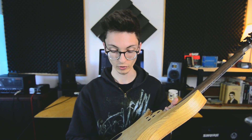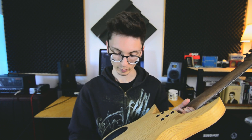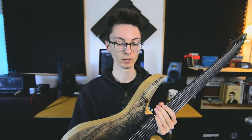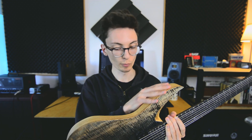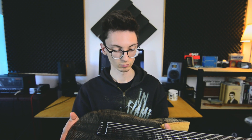I think I'm going to try a natural finish — tung oil or some other natural finish — for my next build, which is also going to have a swamp ash body. I should have used some grain filler beforehand because the wood really sucks up a lot of oil, especially on the sides. It feels like an open pore finish, which is nice, but to really get that satin glossiness, pore filler would have been useful here. Maybe on the next one.